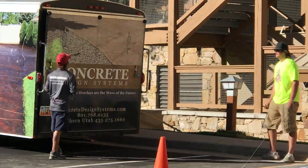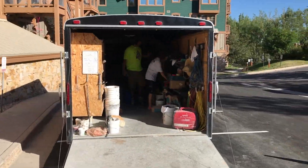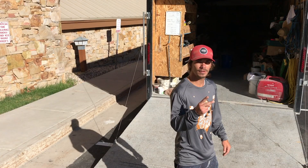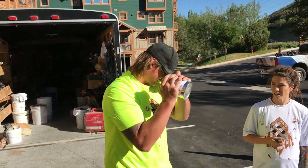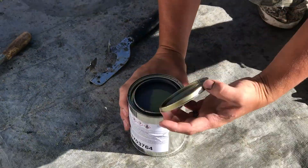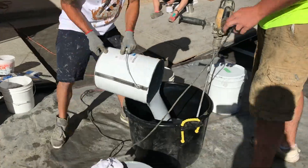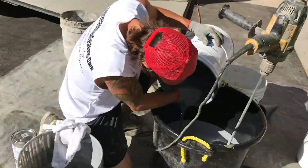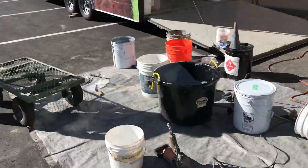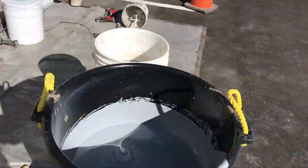The last phase is to put the glaze or final finish coat over the urethane already in place. The same process applies: add the color, mix it into the urethane to make a homogeneous and consistent mix. Fortunately, with this glaze coat we have a longer pot life of approximately three hours, which gives us a little breathing room.